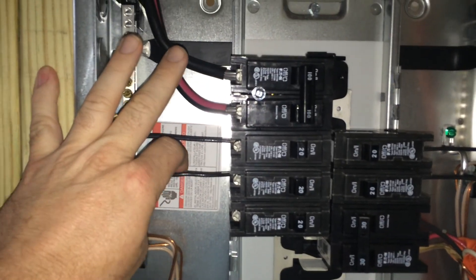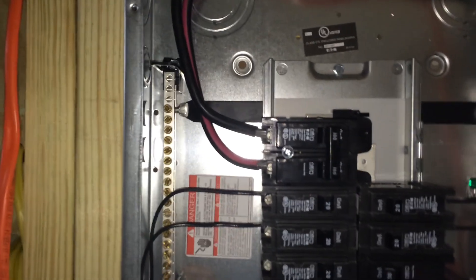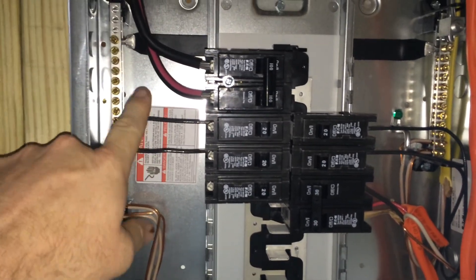Other than that, I'll go over basic wiring later — your hot wires go into the breaker, your neutral and ground wires go into the neutral ground bus bars. I like to keep everything squared, clean, and tight in the panel.